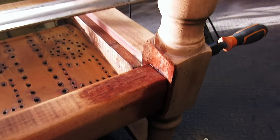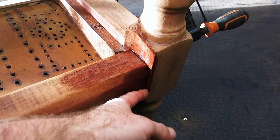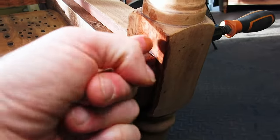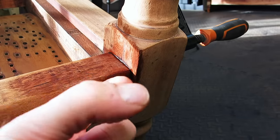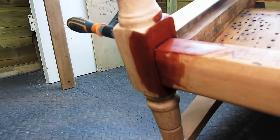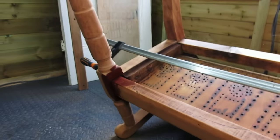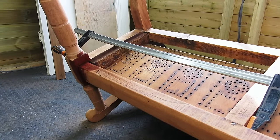I forgot to hit record on the camera when I was doing these repairs. All it is — the legs were slightly loose. They weren't coming away, but because of the way it's nailed in the seat I couldn't take it all to pieces. So I just knocked the joint open a bit, got some glue in there — I can see the tenons, the little dowels — I got hide glue all around them, done the same with this one, clamped them up, and I just need to leave them to dry. Apologies for forgetting to hit record — I do that quite often — but that's the repair done.